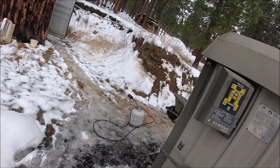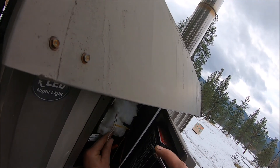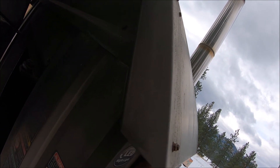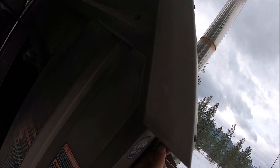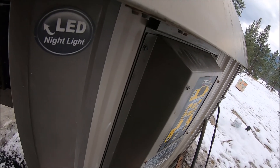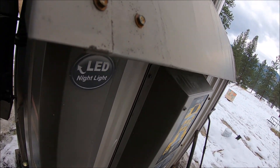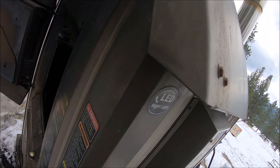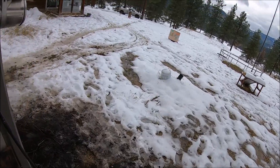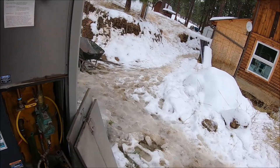I know my water is good, so I don't have to worry about the low water fault. I'm just going to leave that bypassed until I feel like dealing with this properly, which means I would have to drain some water, then take that float out and see what's going on — maybe it's just stuck. But at this point I'm happy we're going again.